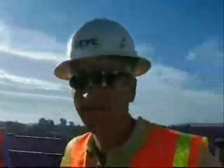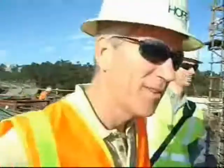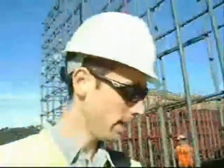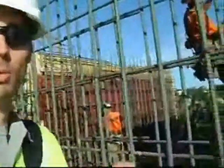Okay. So this is it. Here's a shear wall. There's rebar. I recognize that. It handles lateral movement in the building, also serves as a support structure in between floors. You must have your degree in engineering then. I'm getting it today. This is neat. This is then behind the scenes what that shear wall looks like inside. You can see a cage coming up from below, and then it stops right here, and then they drop another cage of reinforcing steel that sets right on top of it. And it collapses together and splices into one strong cage.